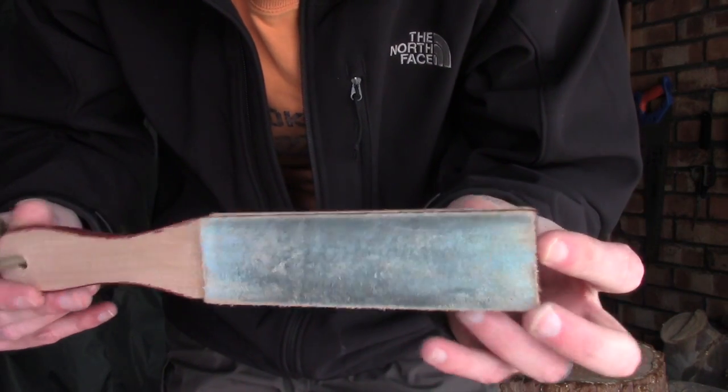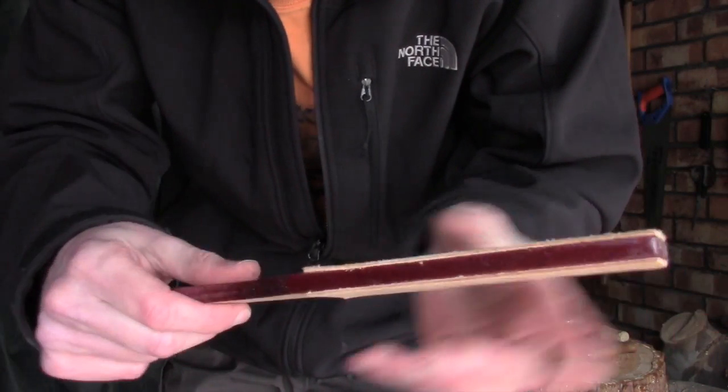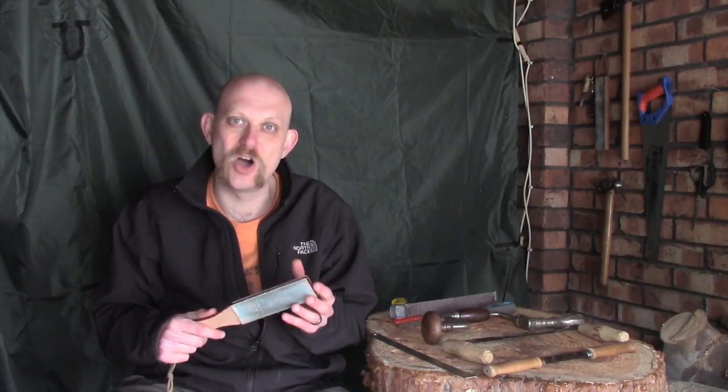This is my leather strop. Essentially it's a flat piece of wood with a piece of leather over the top. In conjunction with a little bit of honing compound - I use something called Starkey Blue, also known as Smurf Poo, but you can use Jeweller's Rouge or Auto-sol, which works really well. When you're using bladed tools for carving, they get dull after a while and you have to maintain them. You often don't need a sharpening stone. For me, every time I've finished using a tool - unless it's been a particularly heavy carving session - I'll strop it with a little bit of stropping compound, and that's normally enough to bring the edge back to full sharpness. If you do that regularly you'll really help to maintain your tools.